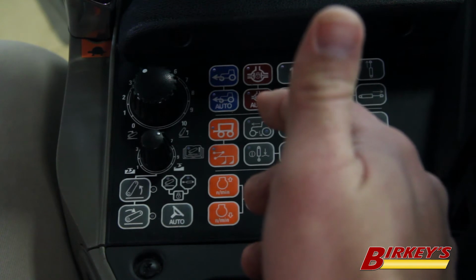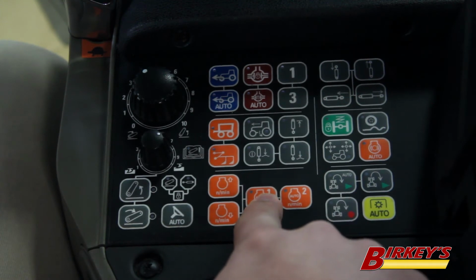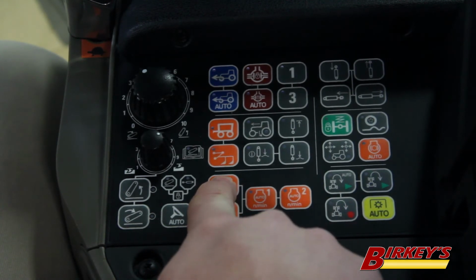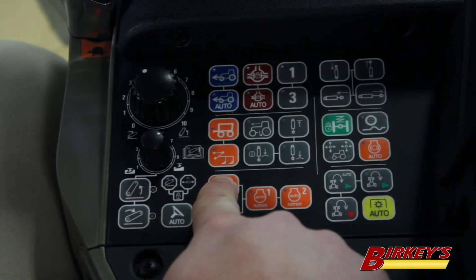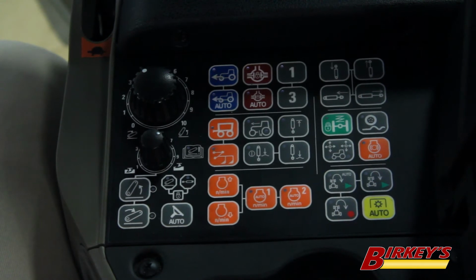So to set constant engine RPM for your planter, you're going to press set point 1, turn constant engine speed on, and then use the up arrow and adjust your speed set point to whatever engine RPM you'll need. Then when you're running your planter, you can just leave your throttle lever all the way forward and not move it, and you'll have a constant RPM and your hydraulic flows will remain constant, and you won't have fluctuations with your fans and bulk fill and things like that as you're turning around in headlands and operating throughout the field.